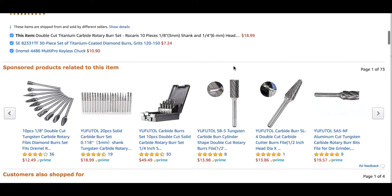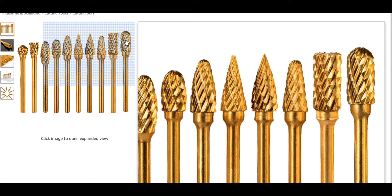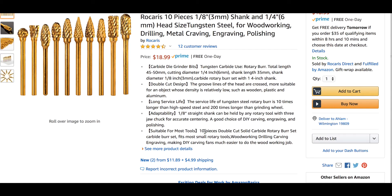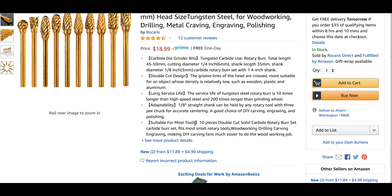Make sure it is YG8 or YG10 — you can go up the scale a little. You do not want plated stuff — you want solid heads. When they say 'solid carbide tungsten carbide rotary burr,' you want a solid head on that tip. The shaft doesn't matter as much — just make sure the head is the actual carbide. This solid carbide rotary burr set is definitely usable. Be aware that they often size these at just under a quarter inch, so check the comments — it might not fit your chuck properly.